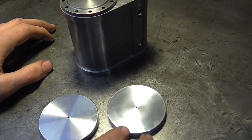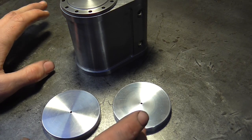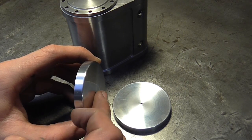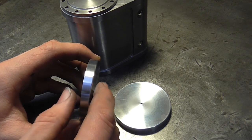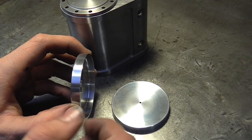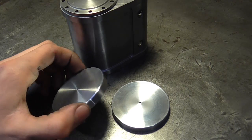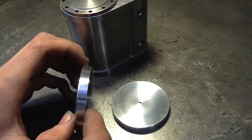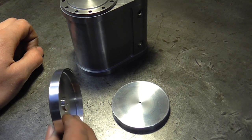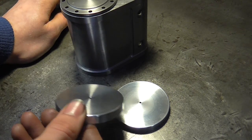That's about it for today. As for the method, you could also have done this using soft jaws. I don't have any, but if you did you could quite easily turn all this in the first stop, drill the hole, same on the other one, then bore the soft jaws and do everything around here. All I will say about the pressure turning method is that you could probably get away with doing something even thinner. If you're interested in the pressure turning method, have a look at Joe Pisinski's video called Machining Ultra Thin Washers and Spacers — that's where I got the idea for this method.